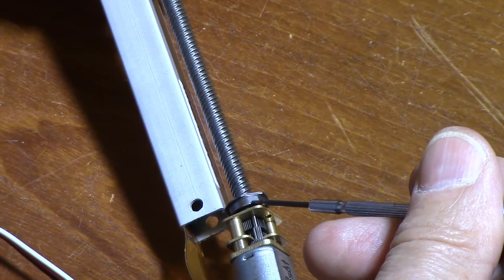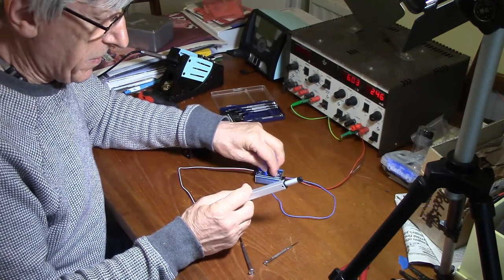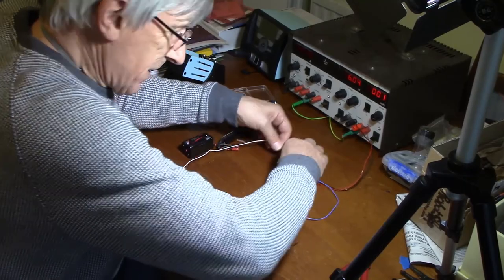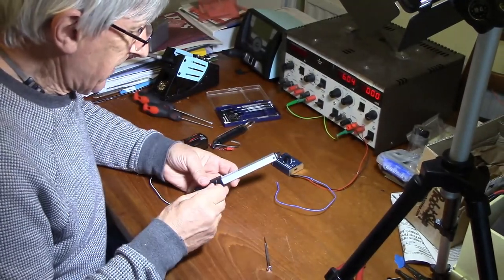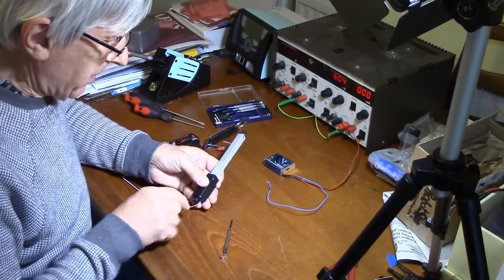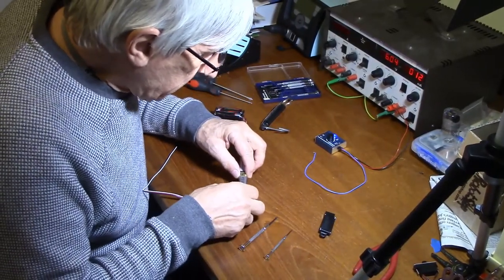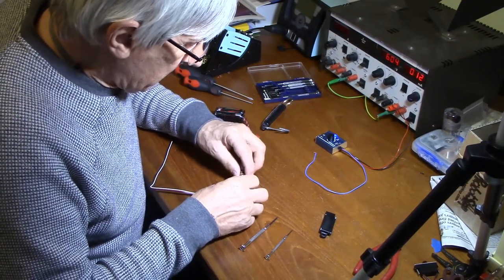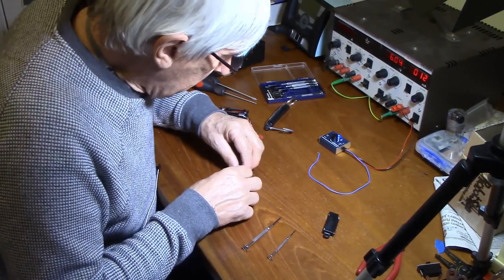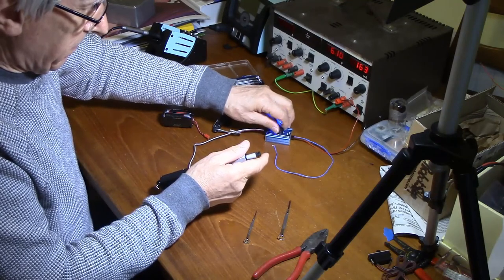Yes. So that bearing has both a flange on the left-hand side of it and a flat. Is that catching the light? Yes, a flat there. It just makes the same rubbing noise quicker. Right. Okay. So you can take it apart again. I'm going to take it apart again. We could be here some time. If this goes on much longer, we might have to have a drink, you know, Dick. Okay. Right, so we think that flat on the ball bearing should be adjacent to the potentiometer strip, so that the ball bearing flange doesn't dig into the flexible circuit board kind of thing. I think that's all right.